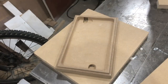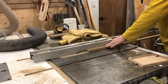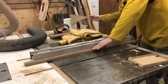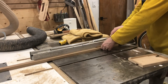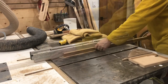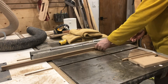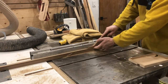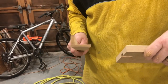The one thing I'm not going to be showing in this video is how to make the insert for the tablet itself. That's just because I did my iPad wall mount video earlier on and the process is identical. So to get started on this project, the first thing I did was build a picture frame for the insert to fit in. The reason I did it that way was so that if I did want to change the tablet to a different brand or a different make, all I would have to do is change the insert instead of having to remake the entire cabinet. I thought this was a logical means of doing it, and the picture frame itself is what I started with.